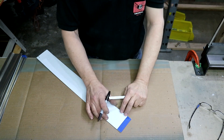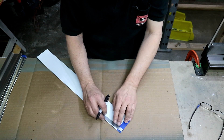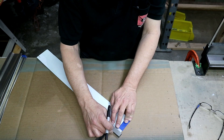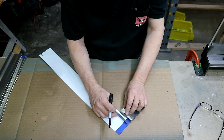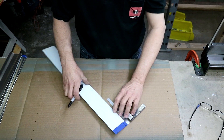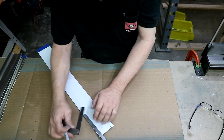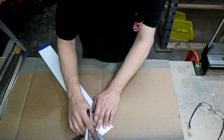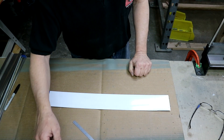This sheet is about 3 inches wide, which is close enough. I scaled that off to print. I just take my half-inch wide rule, set it up here, and make some marks at half an inch. I'll do that on both ends. Those are just my bend marks, and now I'll take it over to the bender.